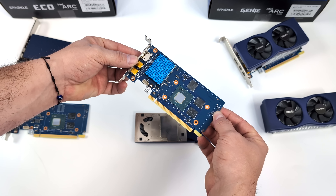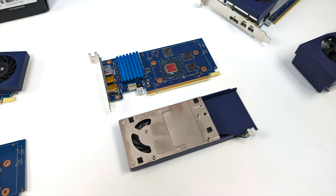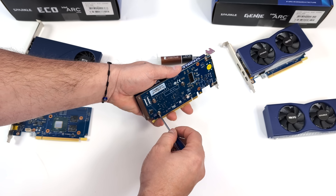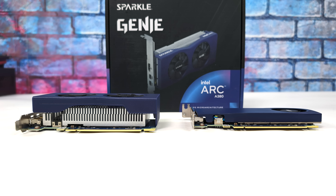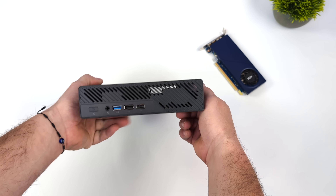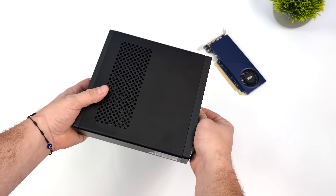With this low-profile cooler, I've been able to go up stably to around 52 watts with higher clocks and get some really great performance. This definitely isn't going to be for everybody, and it'd be really nice if an aftermarket company came up with a solution — some type of copper heatsink that would fit this low-profile A380. One of the big reasons I wanted to get this to a single-slot form factor was for these smaller PCs from companies like MinisForum, like the MS-01.